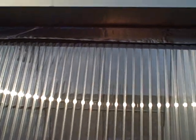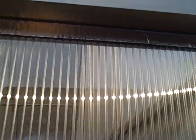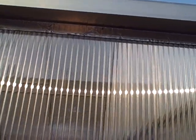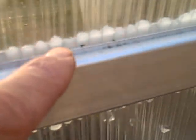One of the things you can see is along every top and bottom of each panel, we've put this weatherproof aluminum-colored tape. This basically seals the panel so that the inside of the panel never gets any moisture in there, because on the other greenhouse, trapped moisture has been an issue. We did attempt to glue the panels first with some silicone, as you can see down in there, but that wouldn't really work too well — the silicone would work its way up and you could actually see trapped moisture in there, which isn't too good.